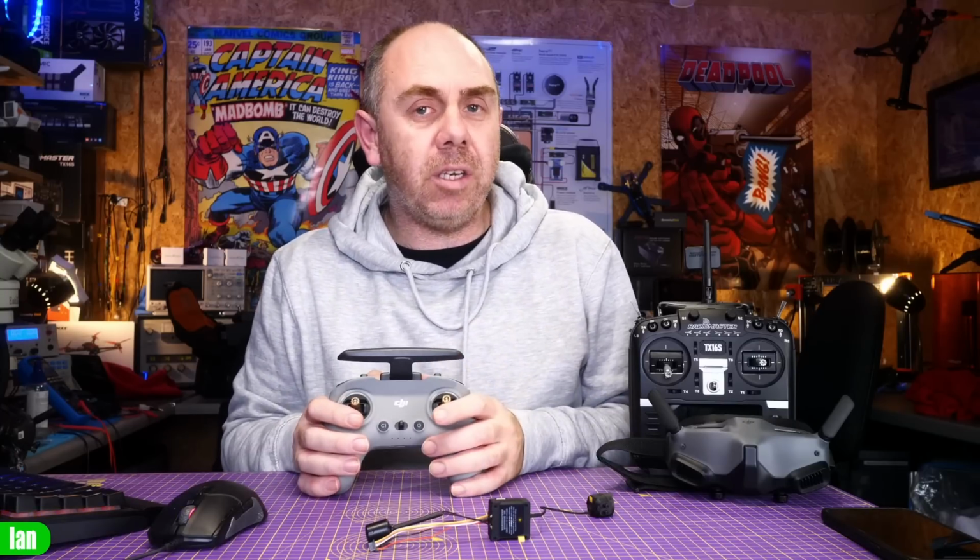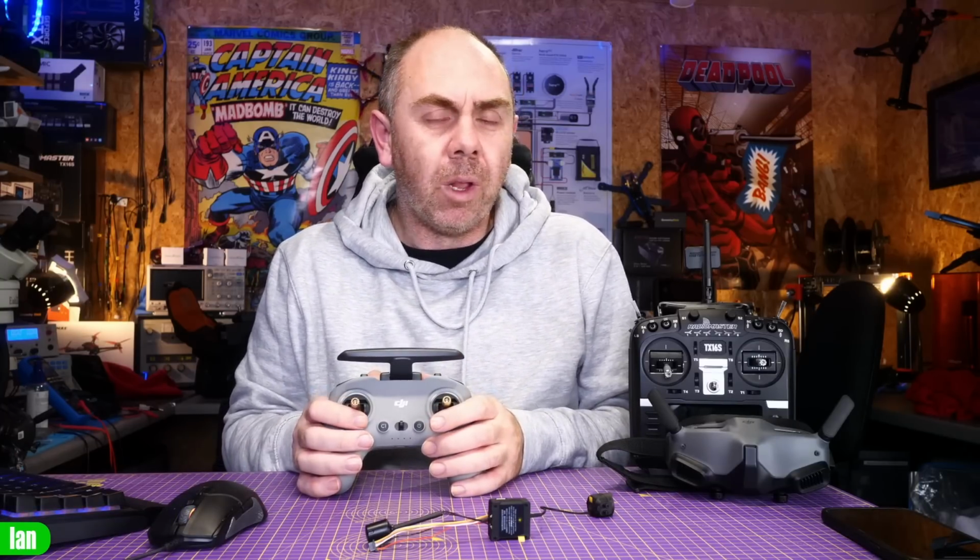with your DIY drone because you don't have the ability to easily recover in the event of a goggles video signal loss. Whilst there isn't a lot you can necessarily do without video stream, you still can punch out and you could still manually trigger failsafe in the event of a video loss on a normal system, but unfortunately, in reality, you're not going to be able to do this on this. Potentially, you could set your failsafe settings on Betaflight to ignore it for 5 seconds, but that would probably be insanity. It'll probably end up in a hedge or something by then.